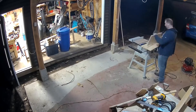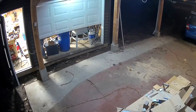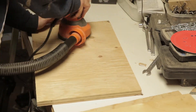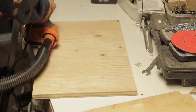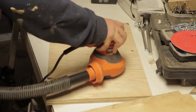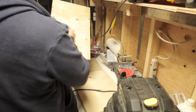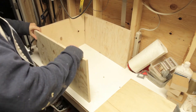I figure I'll build myself a small cabinet. I found some scrap construction plywood — some three-quarter inch and some five-eighth inch — and ran it through the table saw to get it cut down to size. I decided on about 18 inches wide and about 25 inches tall, with a shelf about one third of the way up. After cutting it, I hit it with some 80-grit sandpaper just to clean it up so there would be no slivers. Sanding took about an hour to do both sides and all the edges. I always find sanding is a good time to put in some earbuds and listen to books or podcasts — makes the time fly.